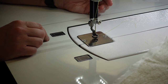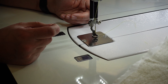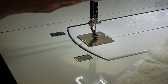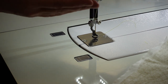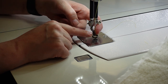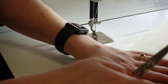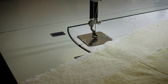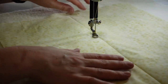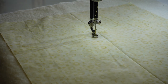I tend to like to change my needles when I get a brand new machine, but I'm going to give this one the benefit of the doubt. If you're having miss-stitching, skipping a stitch, or breaking thread a lot, and you know your thread is good and you've threaded it right and done a tension balance, then change your needle. These needles do not have a flat to them. They have what's called the scarf — an indentation that goes up in the back of the needle — and that scarf points away from you. The eye points towards you with this indentation on the back side. Your book will really show that to you.